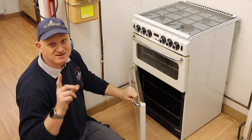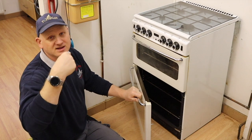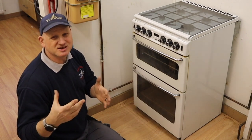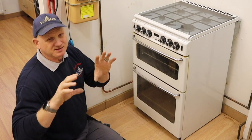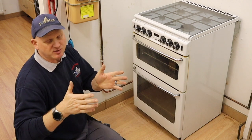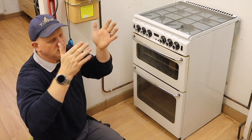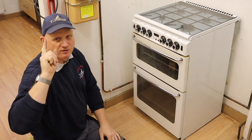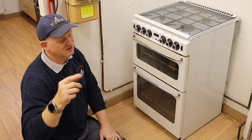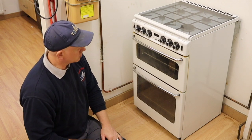There are also safety devices in the oven, and there are two different types: a liquid vapour and a thermoelectric. If it's a liquid vapour, it will light in low rate first before it goes to high rate. But if it's a thermoelectric, it will light in full rate. I've done a full video on the safety controls for cookers, so if you are a gas engineer or a trainee gas engineer, you can go over and check those videos to see exactly how they work.